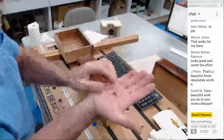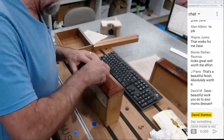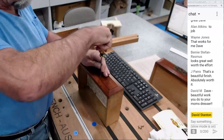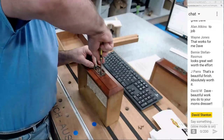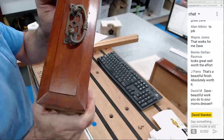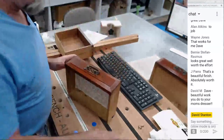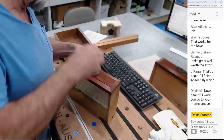And these are the little brass screws. I say genuine brass. And don't worry if there's a little bit of wax left in there, because that will actually lubricate it a little bit as we're putting it back in. I'll line that up and dress the screw. There it is. The screw is now dressed. I don't know if you can see it. So the slot on the screw head is the same direction as the grain. It's just one of those little things when I was an apprentice that the tradesman thought was very important.